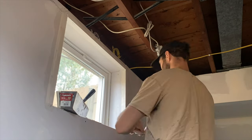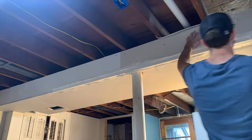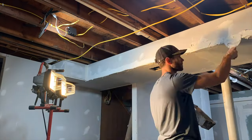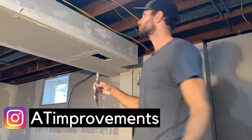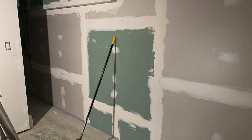Try to make it as smooth as possible to minimize the sanding you're going to have to do later. In my basement I had to install a lot of corner bead around the soffit drop and around all the outside corners — it was a lot of work, and this is one of the reasons why hiring it out might be the best bet. It really did take a lot of time. So after taping all the seams, inside corners, and outside corners with corner bead, here's what your basement will look like. After installing the tape with our six-inch knife, the drywall finishing process is basically just two more passes with a drywall knife to feather out the edge and make it less noticeable.